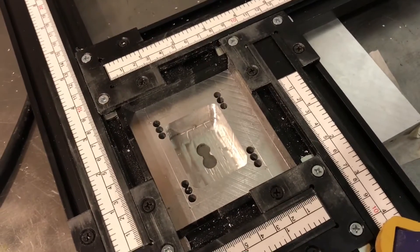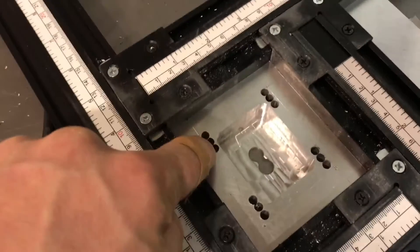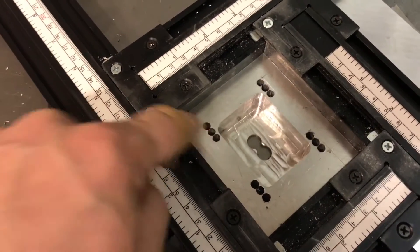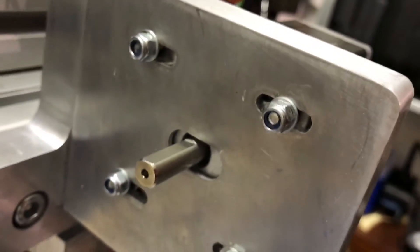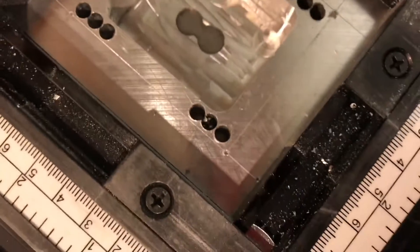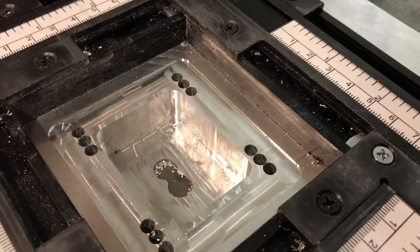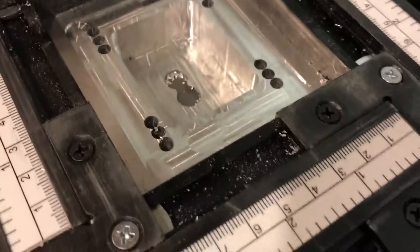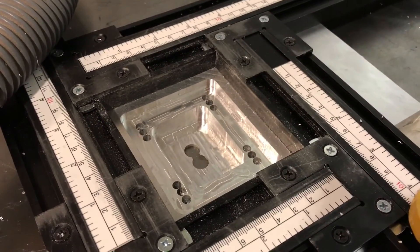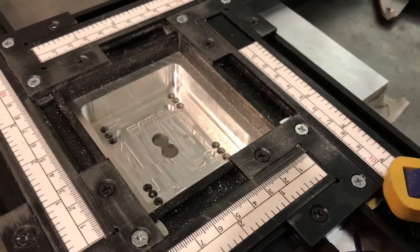All set then for the big pocket that sits around this one. These little holes here are going to form the slots for mounting — if I show you on the other one, it will be these slots here, so I'll file off the little joints between and neat them all off. It's left to one pass, half a millimeter off — six mil down, ten to go. And there we have it, the pocket complete.